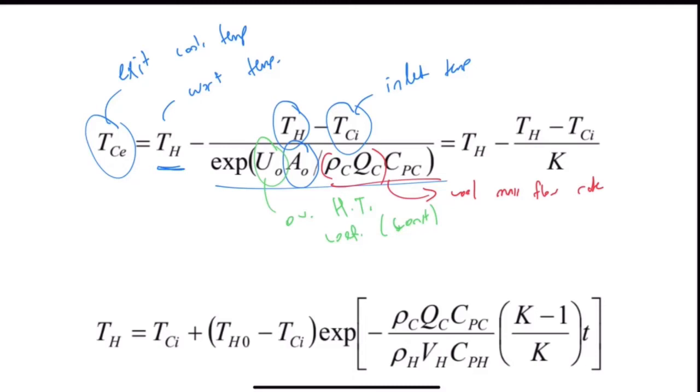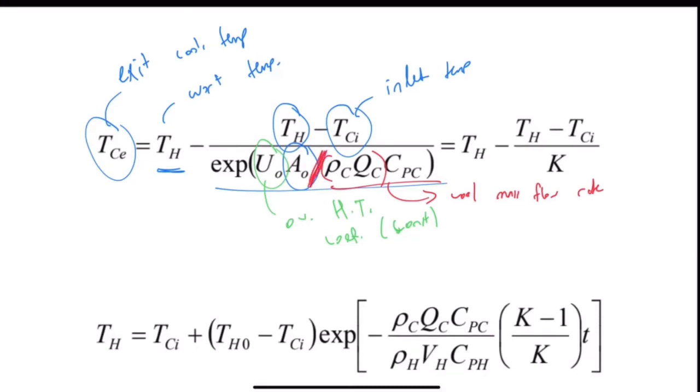So with this, we can flow a lot more coolant in, but what we're going to note is that we've got this term in our denominator. So the more coolant that we continue to flow, it's going to become smaller and smaller returns on our investment. Coolant gets more expensive the more you waste, because in our case, we're just dumping our heated up coolant down the drain. But even if you recycled it, there is a cost of having higher flow rates, and that comes in the form of having bigger pumps.